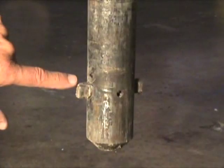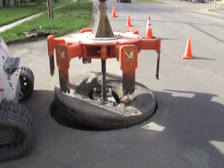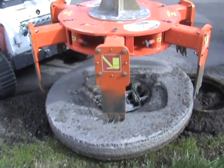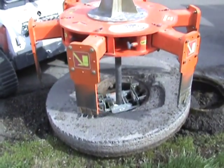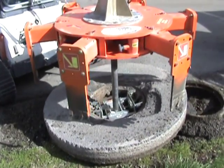On the shaft of the cutter, the key-shaped device on the bottom has keys that must be lined up with the applied decals, which need to align with the ends of the speed plate — that's the proper orientation for pulling. When going to release the donut at the side of the road after pulling it, set it down so it barely contacts the road, then rotate the machine, and it will drop right off.